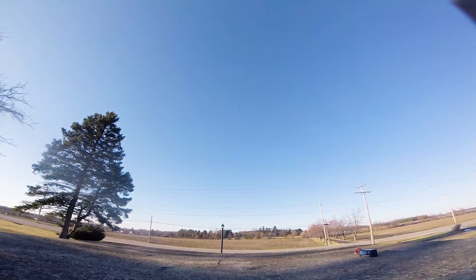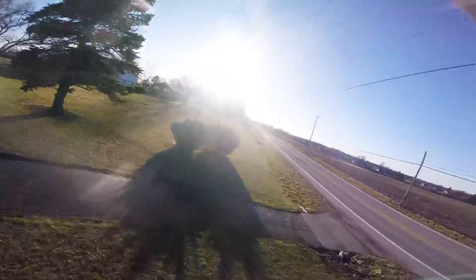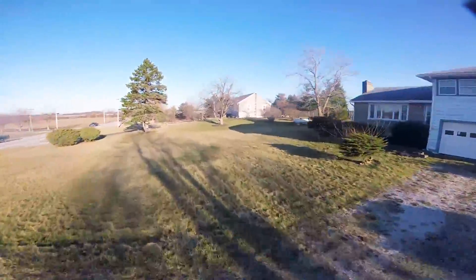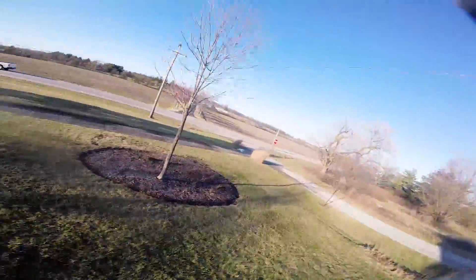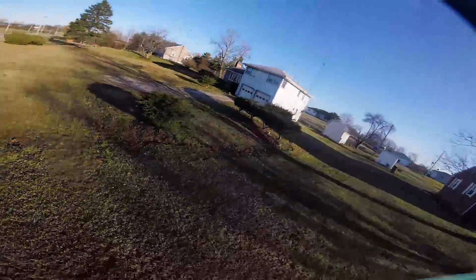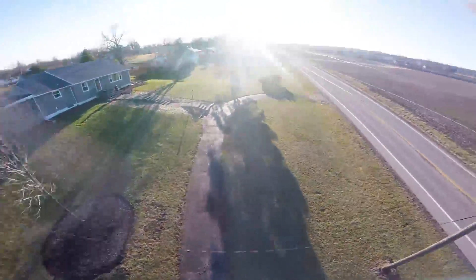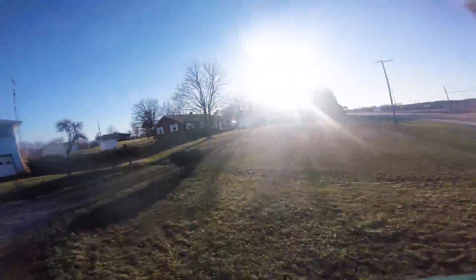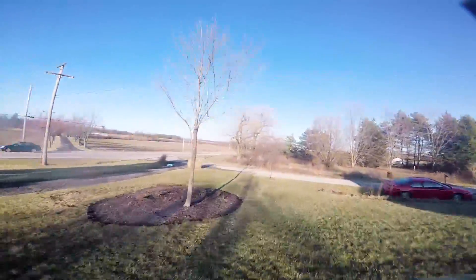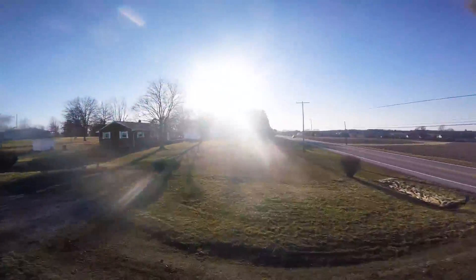The first test is going to be the T-Motor QQ190. We're going to be flying the Turnigy Graphene on the 5038 RaceCraft props. Please excuse the erratic flying — I recently made some adjustments to my camera angle and my Taranis gimbals, so I'm still kind of getting used to it. Plus it was pretty cold out. As you can see, the Graphene is smooth in its power delivery. We all know they don't sag a whole lot until you hit that very last stop, and then the bottom pretty much falls out of the Graphene. On full punch-outs in this setup, I was peaking out around 49 amps.